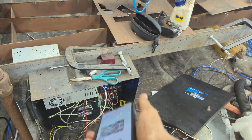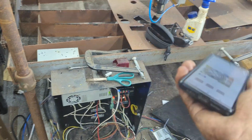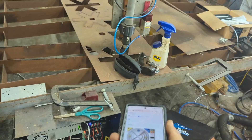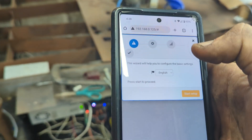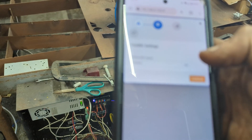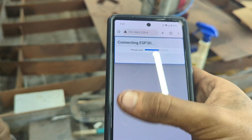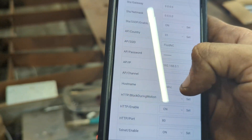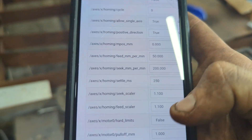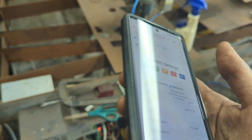This is literally the first time I've ever booted this whole system up and put it together — live on camera. As you see, very easy to set up, very easy to do. And even in the interface, you're able to set up the configuration — start, set up, continue — you're able to set up the steps per millimeter and all that information in here. You can set up all the information: config values, acceleration, steps per millimeter — everything you need, all through your phone or just a tablet.